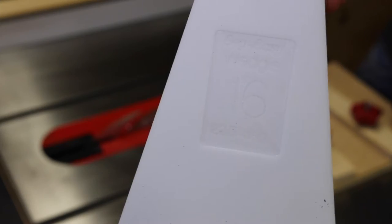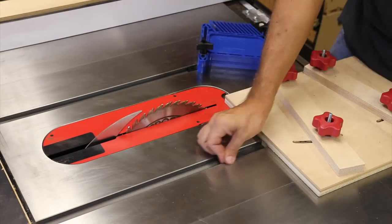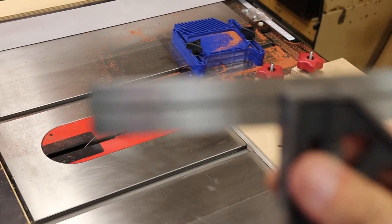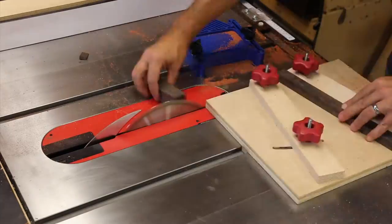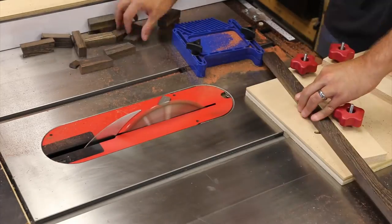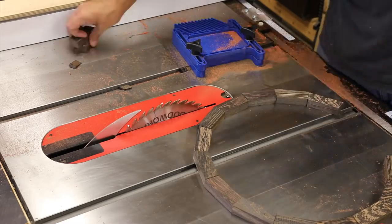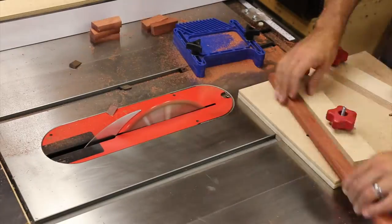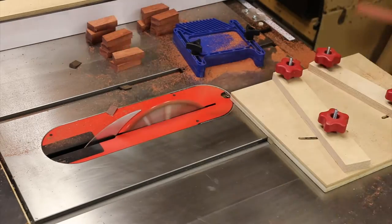What you're looking at here is 16 individual segments. The specific tool I'm using is designed by a guy named Jerry Bennett — it's called the Wedgie Sled. It basically creates a system of ensuring complementary angles that ultimately result in the correct number of segments. For this I'm going to take those pieces of Bloodwood and Wenge and cut them down to roughly two and a half inches at their longest, cascading down to just over an inch and three quarters at the base. The bottom will be solid walnut.